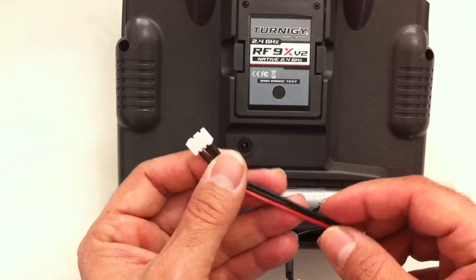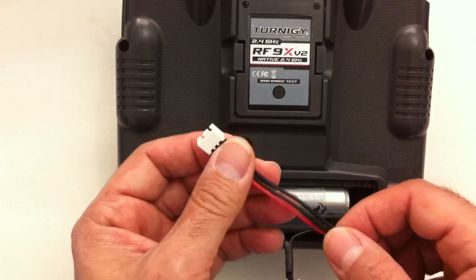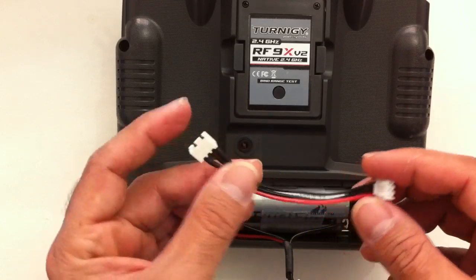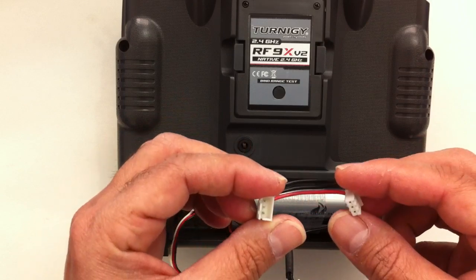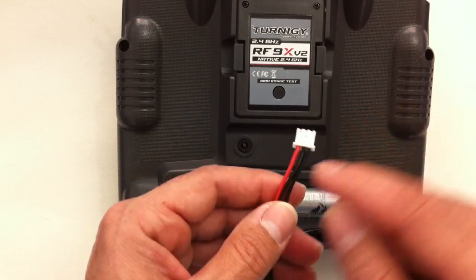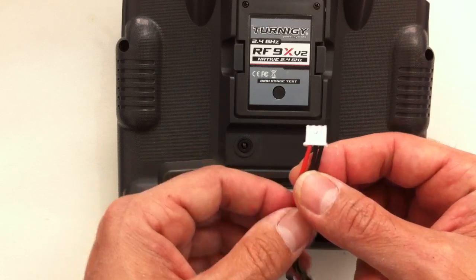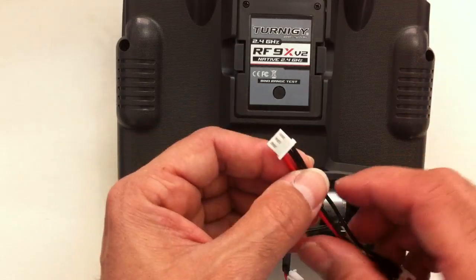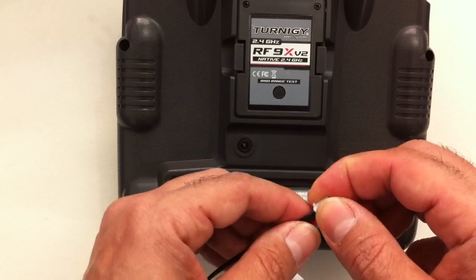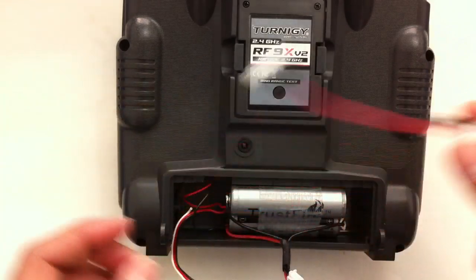What I did was pick up a set of these from — I can't remember exactly what hobby supplier it was, but I'll put the link in the description. What I believe these are is an extension cable. The thing to note with these is the wiring is actually the wrong way around, so the positive is actually the black wire and the other is actually the negative. Irrespective of what cable you use, make sure that you actually get your wiring right. Look at another balance plug that you have and that will make sure you orient it the right way around.